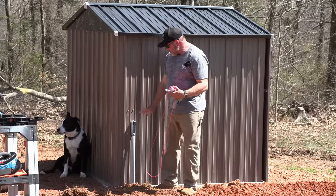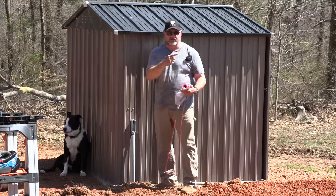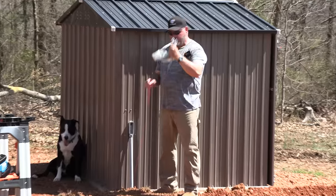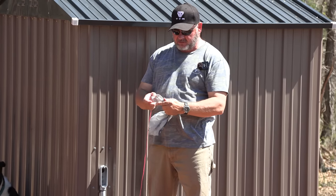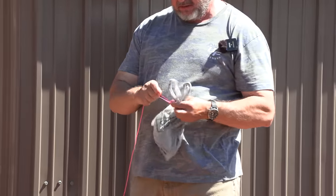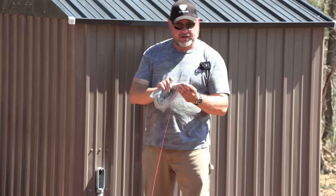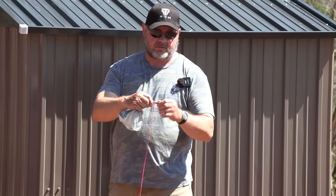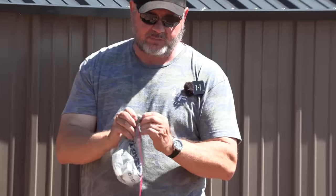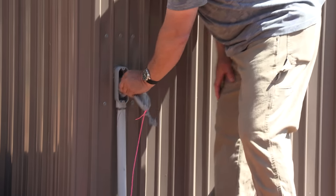You need to be able to put a vacuum hose from your vacuum cleaner on one end. In this case, it's going to be hard to get into one end, so we're going to pull the vacuum through from the easier side. A plastic bag will actually get sucked through the conduit. All you have to do is tie a little knot so it doesn't pull the bag off, then tie a knot in the bag so the string can't pull past it. The bag is pretty slick — that's the whole purpose.